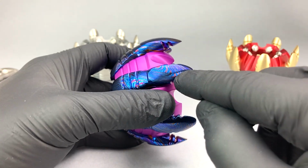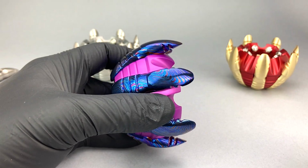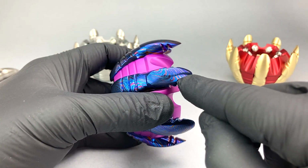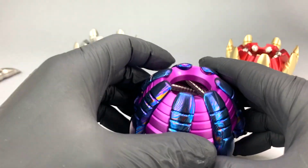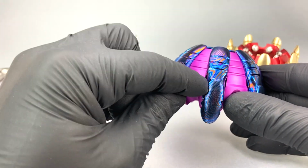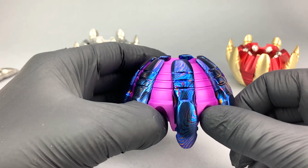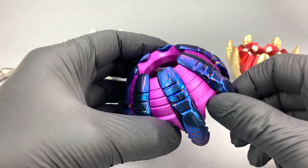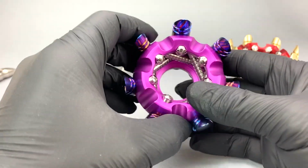But when you stick this in an electric anodizing tank, they all just anodize the same color. They all just go the same blue. So you can't see the pattern when you anodize it in a tank, which I found fascinating. I've not seen anywhere someone explain why the anodizing reacts differently under heat, but not under electricity. I'm sure if I dug around a little bit, I could find it, but anyway, that was a fun thing for me to discover while I was working with it.